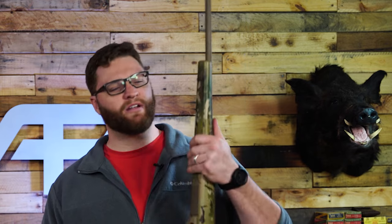Sometimes you'll find that your barrel's threads just aren't the right pitch for the muzzle device you'd like to use. This lightweight Weatherby Vanguard is a perfect example, where they kept the barrel nice and thin to save on weight, but didn't have enough meat left over in the muzzle to create the standard 5/8-24 threads associated with this caliber.